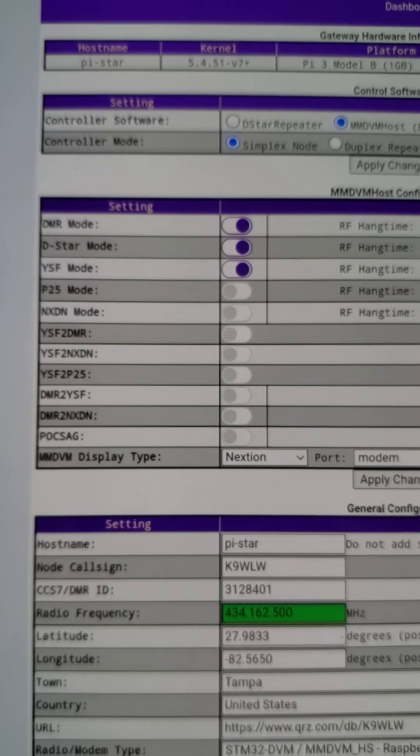The reason I call it locked and loaded is even though I have all three modes on and it's scanning, you will not hear any radio traffic until I make some changes. My DMR configuration is set to connect to Brandmeister 3102. For D-Star, the default reflector is 30 Charlie, but equally important — over to the right of the default reflector I have it set to manual, not startup. If you set it to startup, every time you hit apply changes or your PiStar reboots it will link to your default reflector.